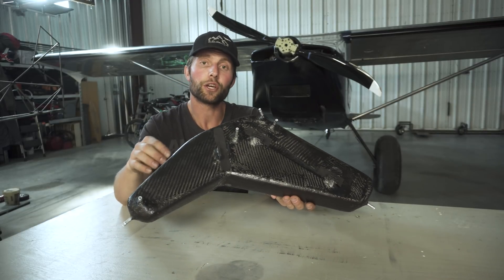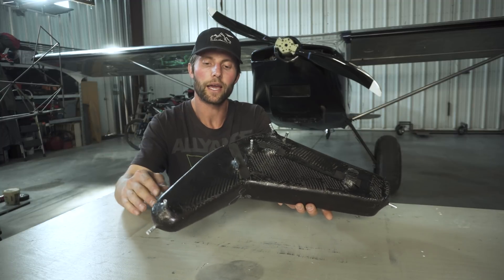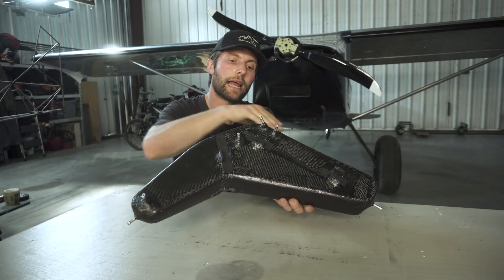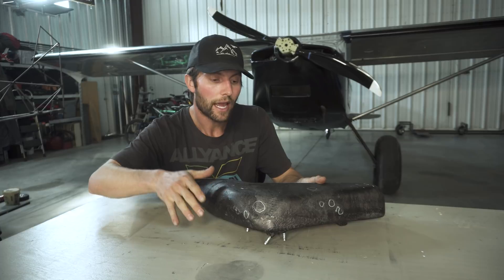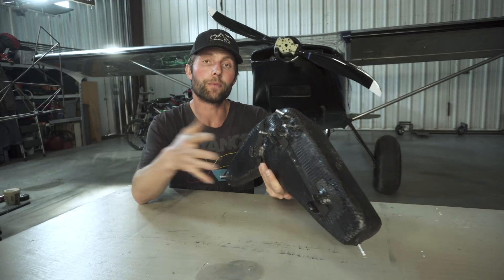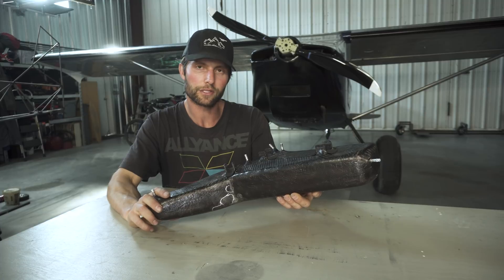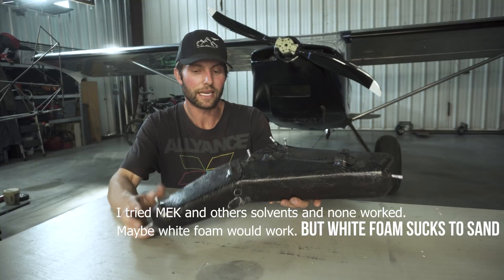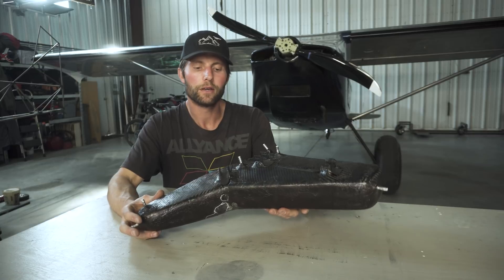If I did it again, I would actually do it in two pieces because pouring acetone in there was just terrible, and you had to cut it in half anyways. You would shape your plug — whatever your tank is going to look like — cut that in half, then lay up carbon fiber on each of those halves and leave a little bit of flange. That way you can pull the foam out of each one, and when you put them together you have a nice flange to seal up. So that's how I'm going to do my next one. I don't suggest trying to eat out the foam with acetone — it just did not work for me. I did a test in a plastic cup and I never could completely get rid of the pink foam.